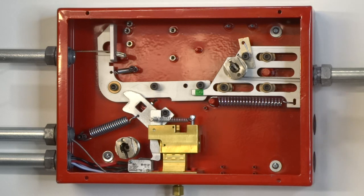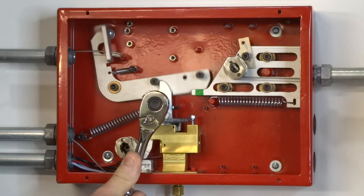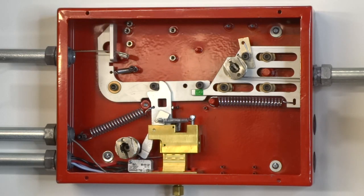After tightening the fusible link line, use the ratchet to place the trigger arm in the set position. Insert the extension bar into the square hole in the trigger arm and rotate it clockwise. The trigger arm will interlock with the locking screw and the actuation lever will engage the gas valve ratchet spool. Verify that the actuation lever is engaged with the gas valve ratchet spool by turning the ratchet spool, and confirm the microswitch paddles are no longer touching the actuation lever.